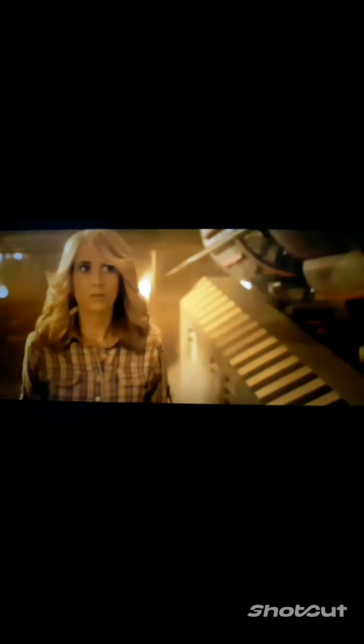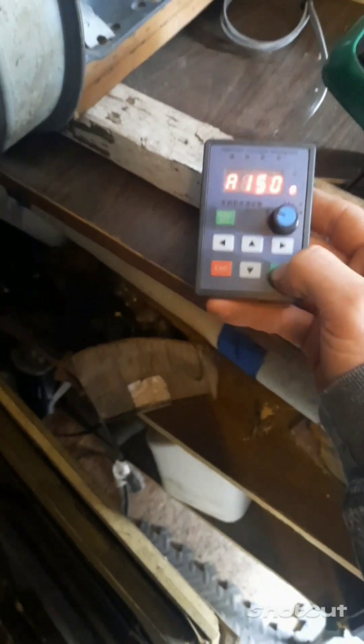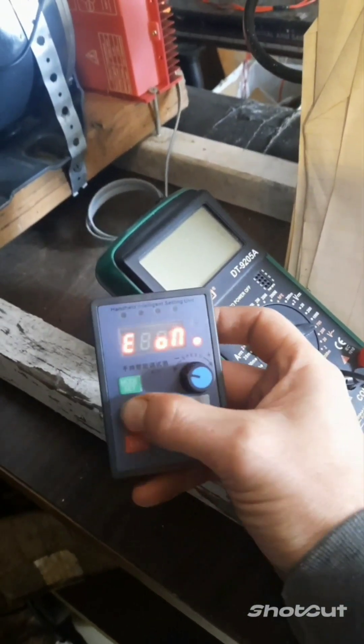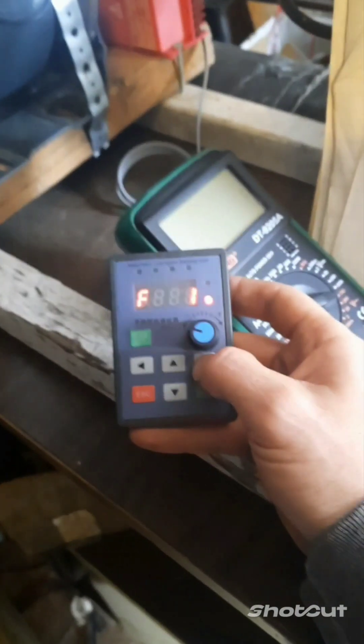If you're a three-wire kind of guy — look at all this crap, there's like a million wires in here. Okay, I just set my amps — hit that button, set your amps, hit enter, go to the next one, move this up. Let's just set that to two, enter. Go up and turn torque off. Two seconds on the start.